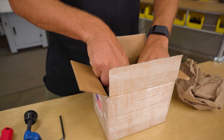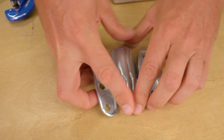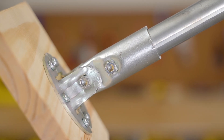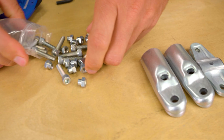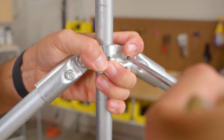To assemble the connector you will need a few pieces from inside your Maker Pipe shipment. You will need four pieces that make up what we call the end clamp, and two identical pieces that make up the middle of the connector. We flat pack connector pieces to save space and cut down on shipping costs. Note that some pieces are shared with other connectors — for example, the end clamp is also used by the adjustable angle hinge connector and the adjustable flange connector. Before you start building, lay out the connectors to take inventory. You will also need four M6 nuts and bolts, which are included with your connector purchase inside a clear bag in your box. To tighten the bolts you will need a single 5mm hex wrench.